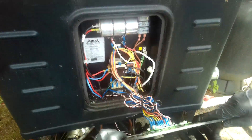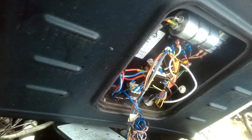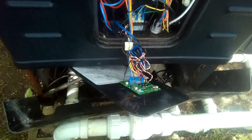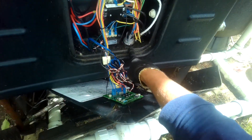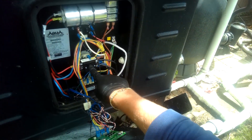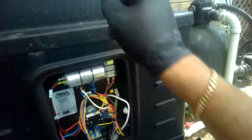Okay, now let's see what we got in there. What are we looking at now? This is called the transformer. That is a water pressure switch — it senses flow of water. That's got to be the compressor up there. This is your contactor. This is a capacitor for the compressor and this is a capacitor for the condenser fan motor.